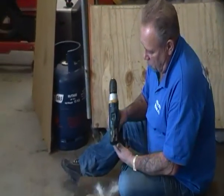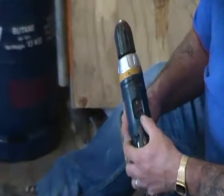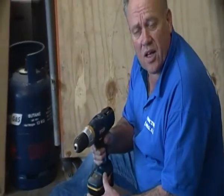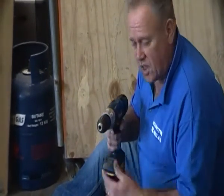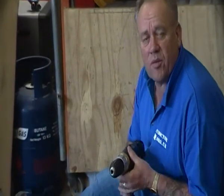This particular drill, as most of them do at 14 to 18 and up to 24 volts, has got two speeds: one and two. If you're drilling through a piece of sheet steel, you'd put it on a slow gear, maybe throw some water onto the steel as well just to cool the drill bit down, to go through nice and gently. For masonry, you'd stick it on the second speed unless you were drilling into something you didn't want to crack — for example, if we were drilling through ceramic tiles with this, I would have it on a slow speed, definitely not on hammer action.